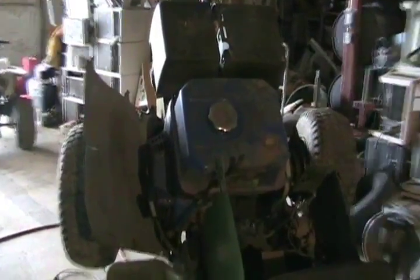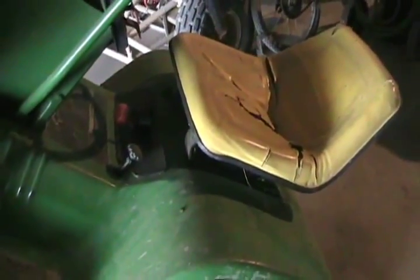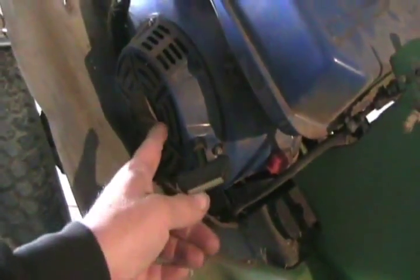It comes with that tiny gas tank in comparison to the big gas tank that was on this machine, but I can cut between four to five hours on this tank of gas. Before, with the big one that was under the seat, I used up that whole tank cutting the same length of time. The pull starter just has three bolts that hold it on — I just took it off and rotated it so that it pointed towards the driver. It still has that problem of not catching unless you give it a quick jam. Simple enough to fix — it just needs more friction on the dog mechanism.